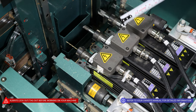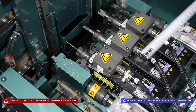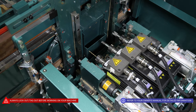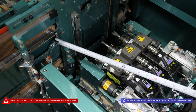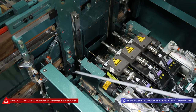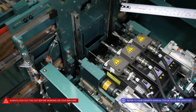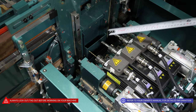For the pre-drill, counter router, and router themselves, they'll be in the front, and those will actually be interconnected with the bearings to the back. For the router heads, there will be four bearings for the horizontal shift: one on top, one on bottom, and same on the opposing side. For the vertical, there will be four bearings, two per rail, one on the top and one underneath it.